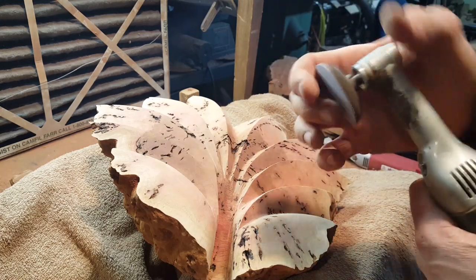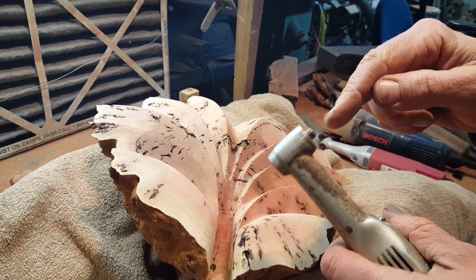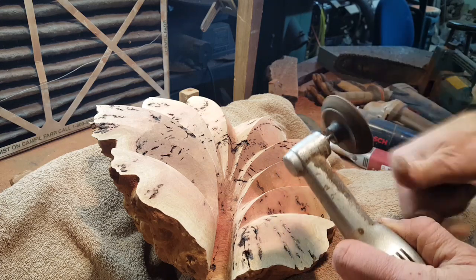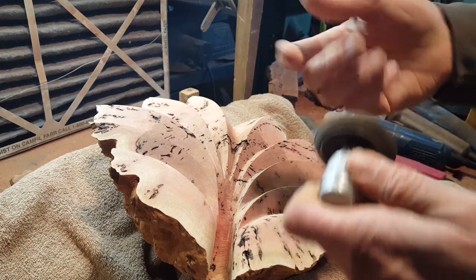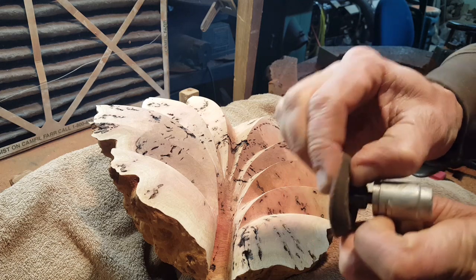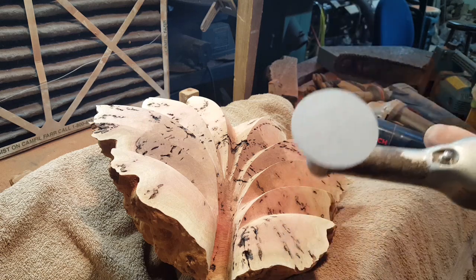Anyway, this is 150 grit on a little homemade sanding arbor. I do not use the tools that they offer, I've talked to you guys about this. I spin off that little top hat that goes over this and just use that 4mm screw there, or threaded hole. That's an old Arbortech arbor. Well, backing pad, flex pad, whatever you want to call it. And this foam here is basically kneeling pad foam for gardening or whatever. So then I just cut my Norton 150 grit.